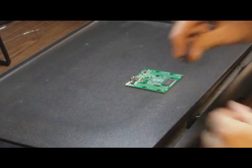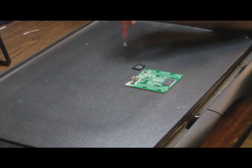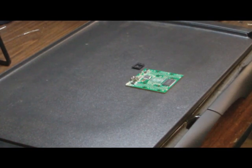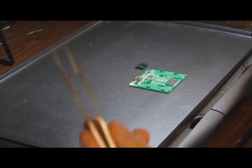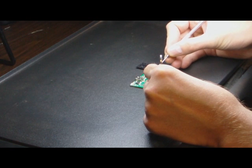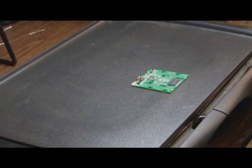I've got the FT-2232 chip ready. I'm going to use my little vacuum picker to take it out and set it right on there, and then I use a dental pick and a magnifying glass to place it. I also use tweezers to hold down the PCB. You don't have to get it perfect — you just want to get it lined up the best you can, because the surface tension of the solder is actually going to pull it into place and help with the alignment.